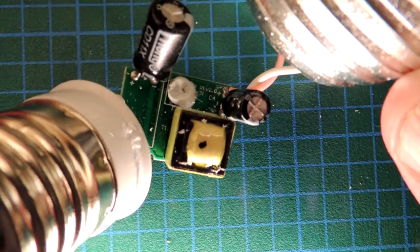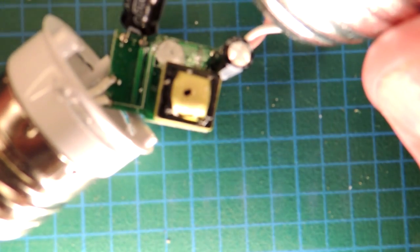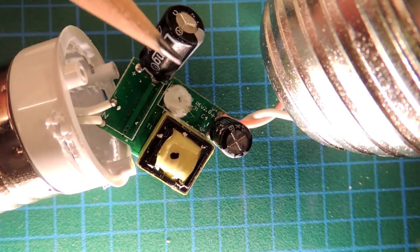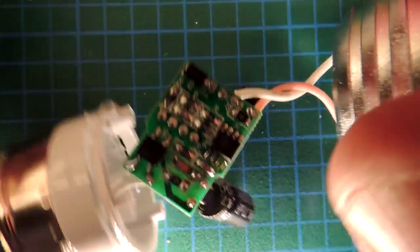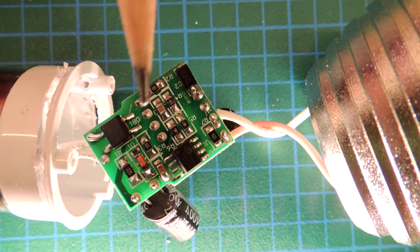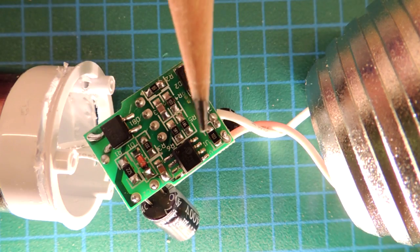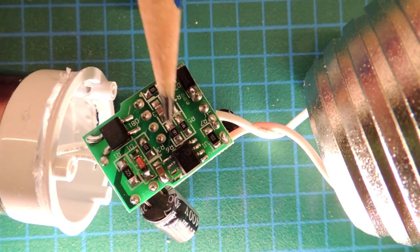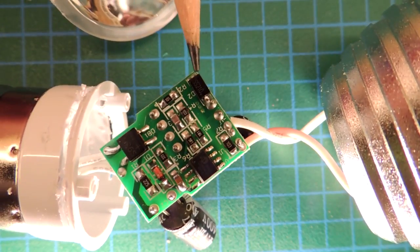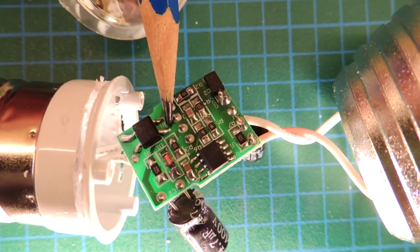Just a closer look at the AC to DC converter: 120 volts AC on one side, 5 volts DC on the other. The yellow item is of course the transformer. It looks like a fully isolated design with a couple of electrolytic smoothing capacitors — one on the AC side, one on the DC. Flipping it over you can see the standard components in a switching regulator. This is a bridge rectifier which switches the AC into high voltage DC. There's a buck regulator here — I don't recognize the brand name, probably an off-brand from the Chinese market. And a diode which creates the rectification on the other side of the transformer.